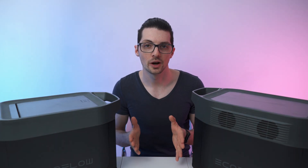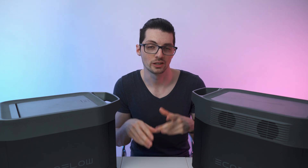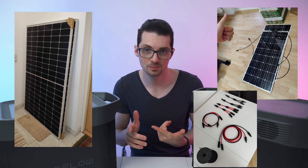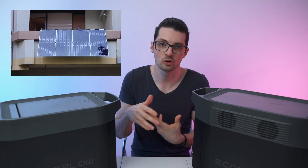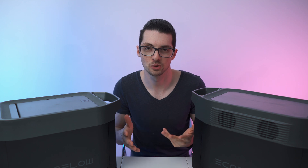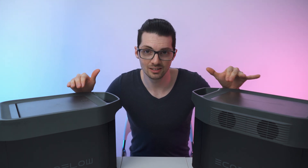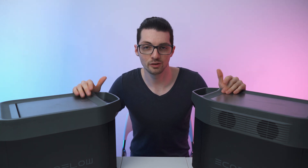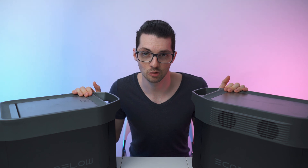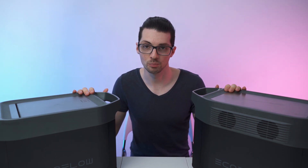First of all, I need to tell you about where you can save money and where you should definitely not save money. You can save money when you buy solar components — the solar panels, cables, all these components. You don't need to go super high-end because it's not really a health hazard; it's outside, not inside your house, and there's not much that can go wrong. But where you should go high-end is the battery, or rather the power station. Usually this is kept indoors, and cheap power stations are not only less efficient — they can also be a serious health hazard. Just imagine if one of these catches on fire. It's game over. So I would not go cheap on the actual power station.